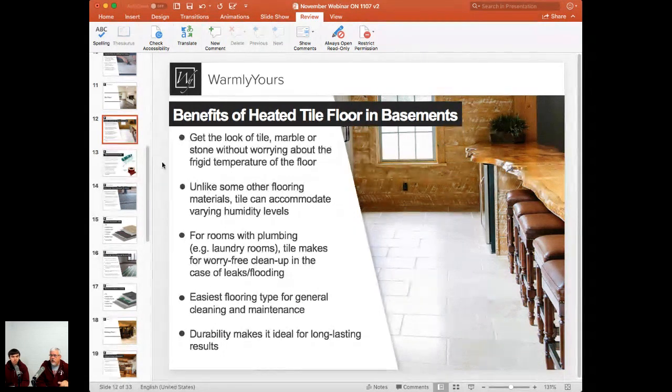because you need to make sure the floor stays in good condition. Now, if for some reason the floor floods and it's underwater for 3 months or 6 months, that may actually affect the construction of the floor. The tile may start to delaminate. The thin set inside may start to fall apart. It may start to flake off, stuff like that. If your subfloor and flooring is beginning to fall apart, that's the case where the wire is actually built into that flooring. So if your flooring has failed, it can cause the heating to fail.